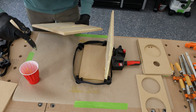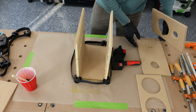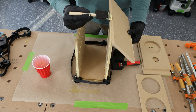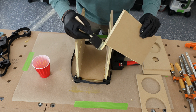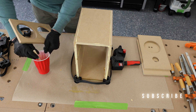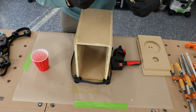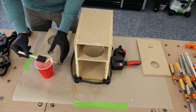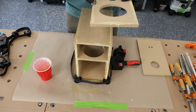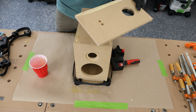You don't have to go crazy with glue either. I've seen a lot of these where there's about a gallon dripping off the sides. You just need enough to completely fill the seam and have contact on both pieces. Ideally, when we apply pressure, we'll get a thin bead coming out of each seam. Titebond 2 gives decent set time, but once you start applying glue you have to move pretty quickly. We don't use any fasteners with this build because they're not required — the glue bond is actually stronger than the wood itself.